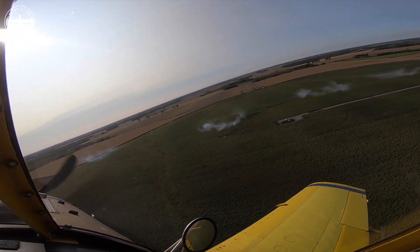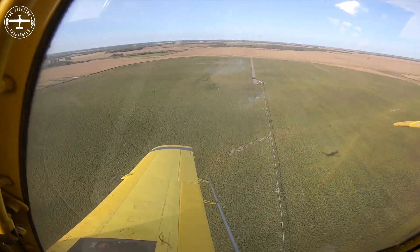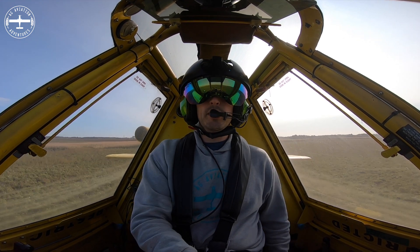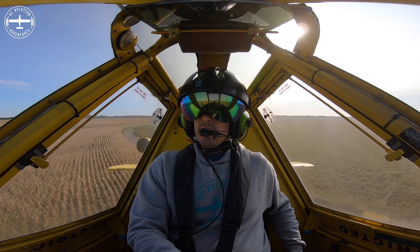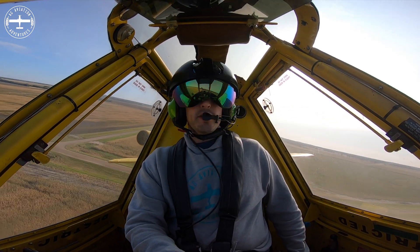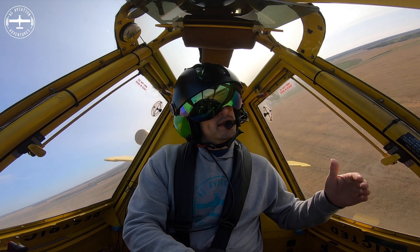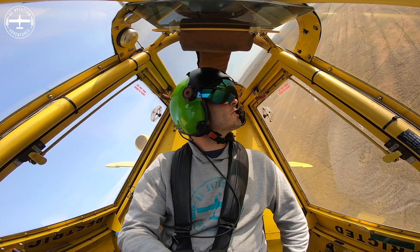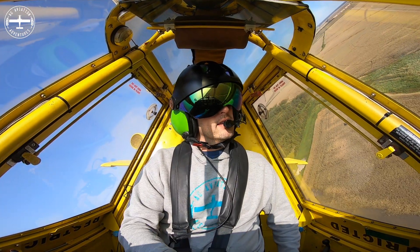You can also get a really good idea of how fast the winds are — what kind of speed you're dealing with. If you have a known distance and a time, maybe you're spraying a quarter section or an 80 — which is half of a quarter — you know what the distance is. So if you smoke the edge of it and then time how long it takes to get across the field, you can actually get an idea in miles per hour of how quickly the wind is moving. Maybe not the most efficient way, but it's possible.